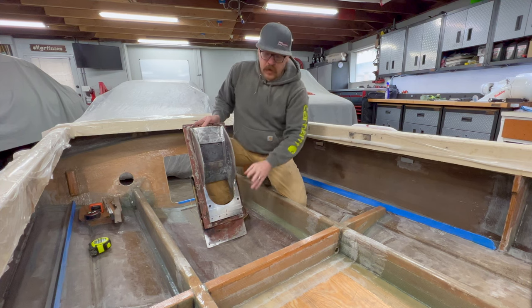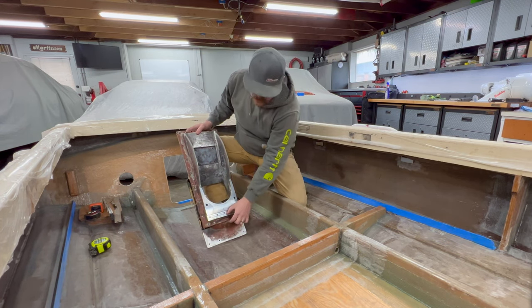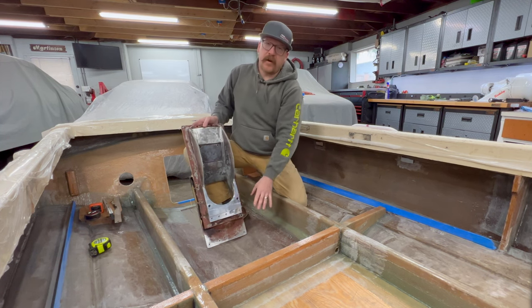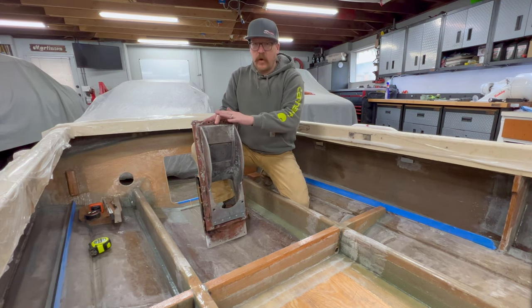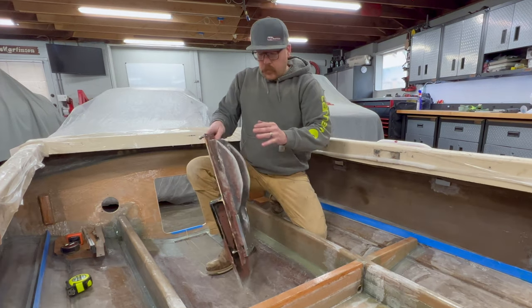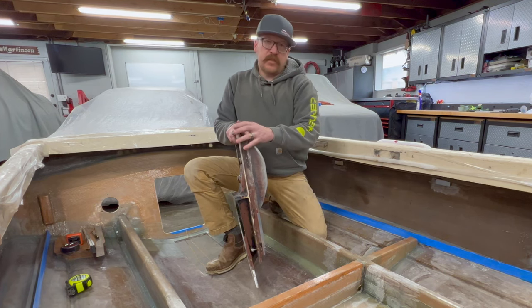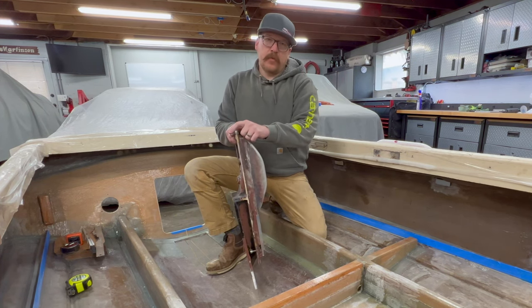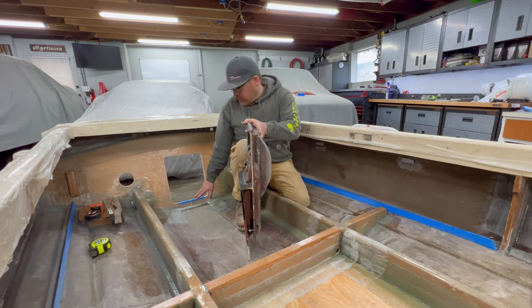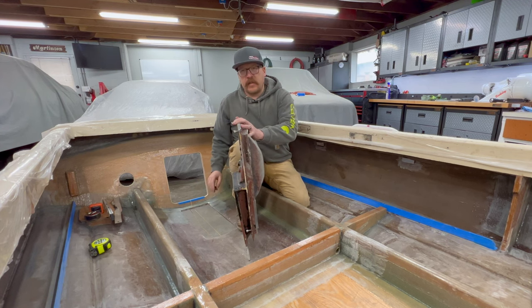I bolted on the shoe with no shims. I want the shoe to be as high up on the intake as possible because where the keel sits back here is more than likely going to occupy some of the same space where the ride plate needs to be, and we're going to have to modify that keel. To get the intake mocked up and leveled, I have three-eighths bolts threaded into the intake as standoffs — most intakes should have provisions for this. I ran some string so I have a rough center point of the keel. Once the intake is resting on the floor of the boat it's entirely too low, so I'll spin these screws in to bring it up and check the bottom side to make sure it's fitting right.